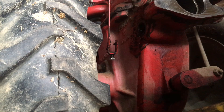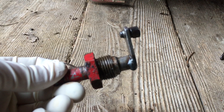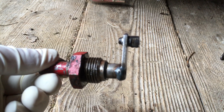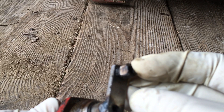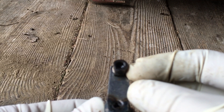Interesting little piece here — this is how the tines on a Troy-Bilt PTO Horse are engaged. Where my fingers are is where the shift lever is, and basically when you engage it you rotate this way and that pushes that PTO back to engage with the tine unit. You can actually see here when I was running it trying to engage it, I was applying pressure and force, and that was clearly wearing this on the PTO shaft itself. So I should probably replace this Allen screw, assuming I can get this PTO shaft moving.